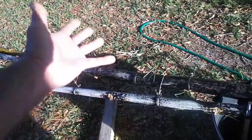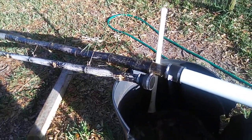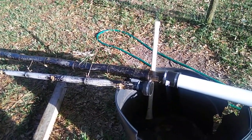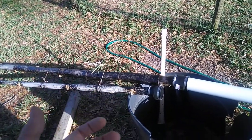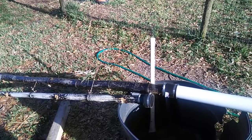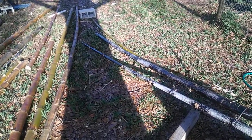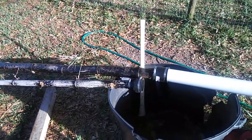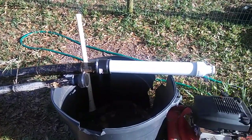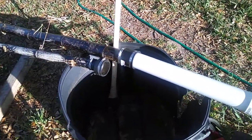Until it comes out the other end, and I have a pole that's preserved. I've heard two things: 25 and 50 years. I think if it's got the coating on there and it's preserved from the inside, it would probably last 50 years, especially if you put some sealant on it too, which I've got a pretty good sealant in mind. So yeah, I'm ready to pressure treat my bamboo from two inch to four inch cut.